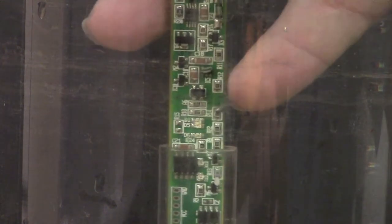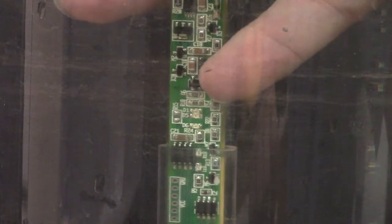If we place the instrument and mount it in the holder tube so that this turbidity sensor ends up above the edge of the tube, it will stay up in the water and you can measure with full accuracy as the instrument was calibrated. That is good enough to measure the sediment plume from dredging, for instance.